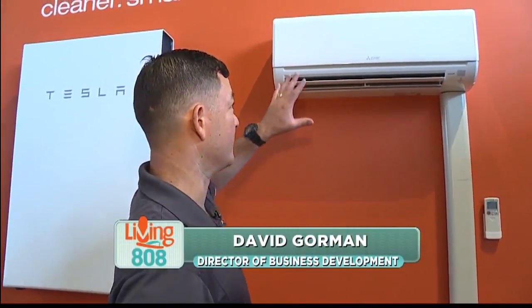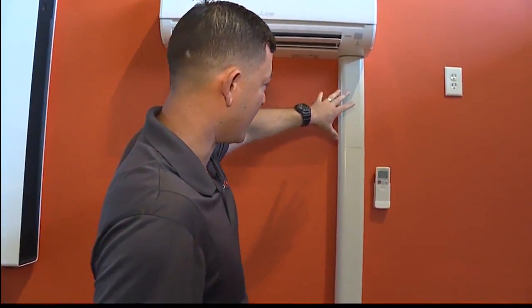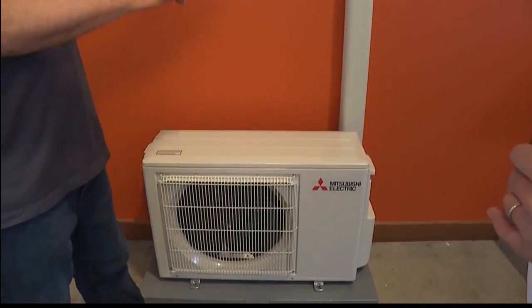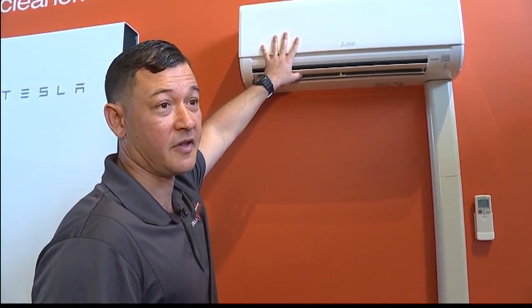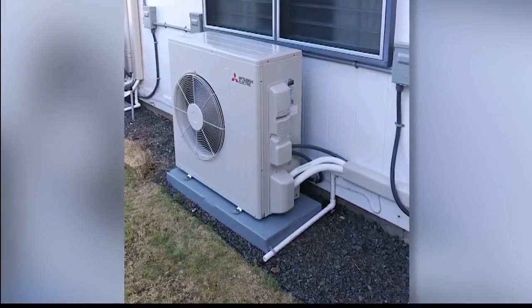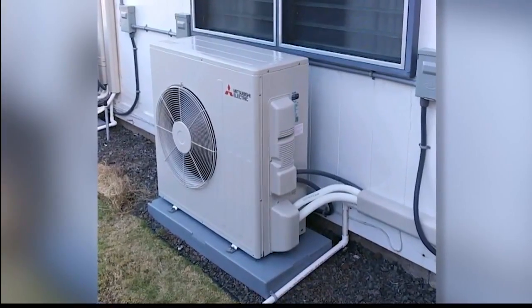Most people are familiar with the setup where you've got the familiar-looking Mitsubishi Split indoor unit on a wall, with slim ducting hiding the refrigerant lines on the outside of the house going to a compressor somewhere outside that wall. What some people don't know is that you don't need one compressor for each indoor unit. They make what are called multi-zones, and we can power up to four or even five indoor units off a single outdoor compressor, so it takes up less space outside. You do want those rooms to be in close proximity — you don't want your refrigerant run to be longer than 65 feet. At my house I have a tri-zone, so I have a single outdoor unit that cools three of my bedrooms.